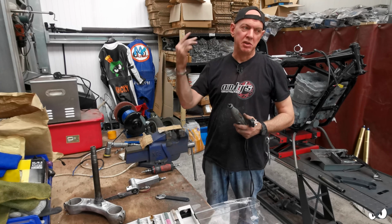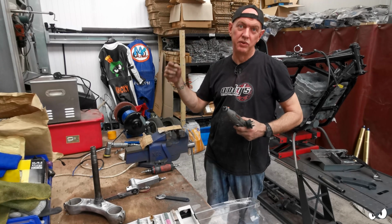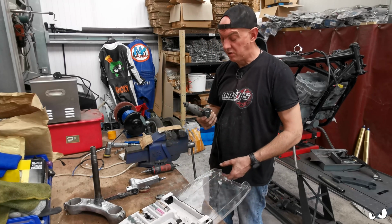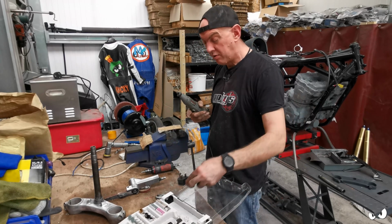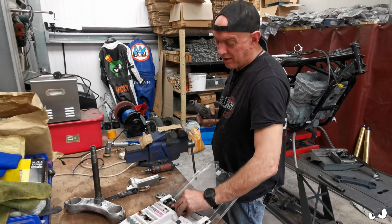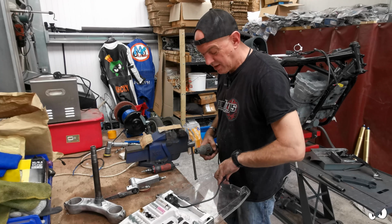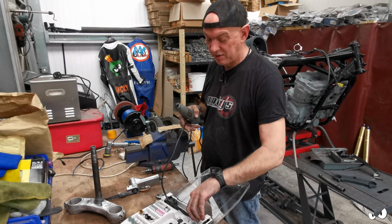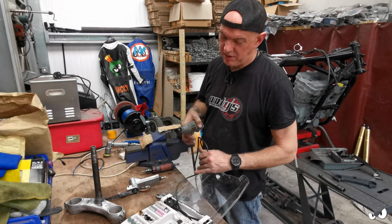So this is where direction of current is basically out of the workpiece and into the torch versus the other direction. So that kind of forces all the sludge and debris and everything else out. And then you have to dab a little bit of filler in there, work it into the porosity, and then sort of try and build on that and spread it throughout the porosity. But it's a nightmare doing cast.